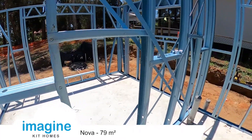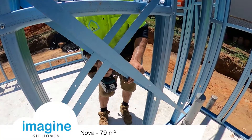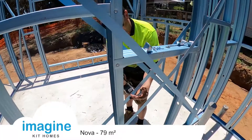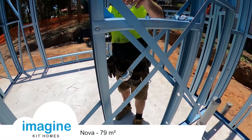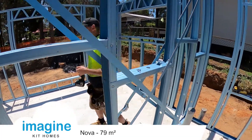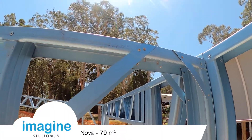This is how you put the tensioners on — this will just straighten up the walls and stop them from raking. These are just strap bracings, going round from the holes in the strapping, and then drag on these little saddles so it goes nice and tight. Once all these are tight you go back and just put a little silver screw in each of these points where it hits a stud or a brace — and head screws.